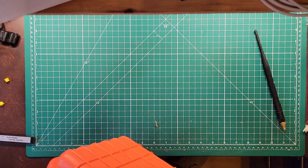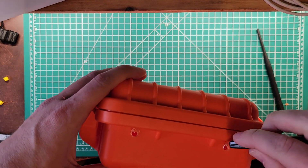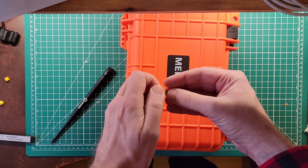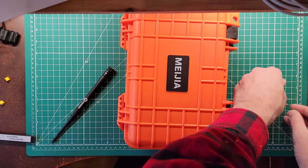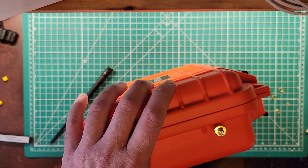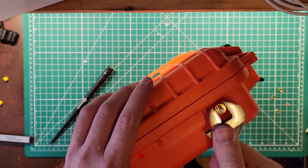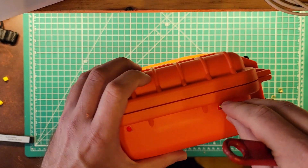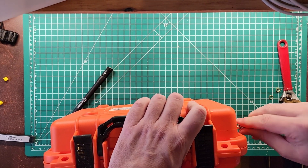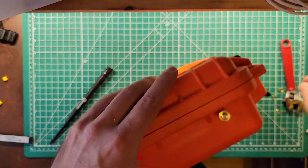They'll survive. Stanley knife to the rescue again here, getting rid of some of the mess that the drill made of the plastic. And here we go, let's get them in. These are bulkhead fittings, so they've got a little rubber O-ring underneath of the exterior part, so they are waterproof by design — which is part of the requirements of the case here, I want to keep this whole thing as waterproof as possible. And I'm taking some extra time here to make sure that they go in straight — straight, plumb, and true — just to give them that much better of a chance of sealing.